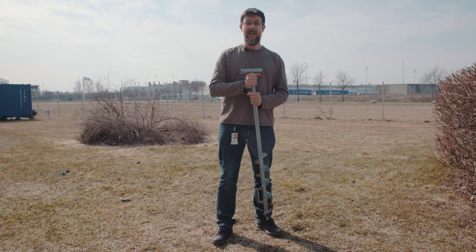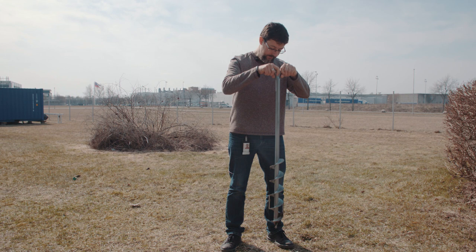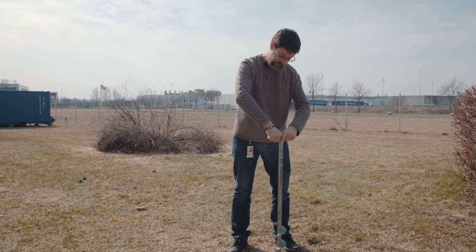We will show you how to do these measurements in an affordable way and in a short period of time. We are going to drill a hole 85 to 90 centimeters deep, depending on the soil conditions. We take an instrument like this one — the beginning is the most complicated part — we put the instrument in the soil and start to move it.